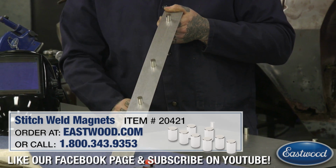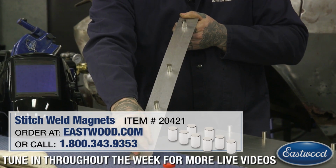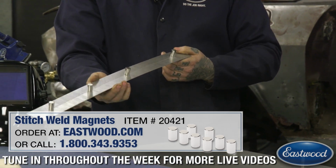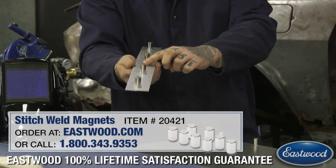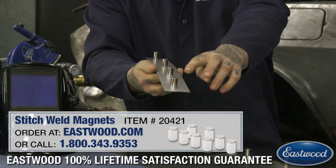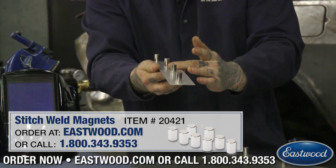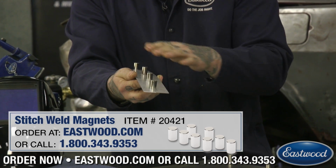With these rare earth magnets, we call them stitch weld magnets, there's a bunch of uses for them. My favorite, which I'm going to show you here, is if you're butt welding a panel, you can make sure that it's completely touching. You can get it so that it bridges the gap and keeps everything nice and flat. So if you stagger these, we know that this butt weld doesn't have a valley in it. We have it perfectly flat and we're not going to be fighting it.